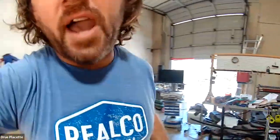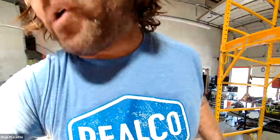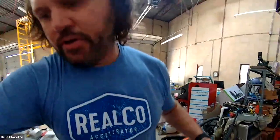I think what's happening is you're just jamming. You may also have a little ball in there. So I would try manually pushing it. If you're pushing it and it's going all the way down the tubing and getting to the extruder, but then not coming out, you probably have a knot in there. There's a way to extract that, and there's a little YouTube video that will walk you through that. That's pretty much common with all 3D printers.